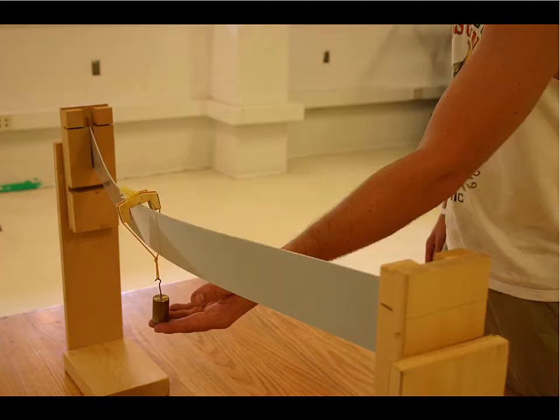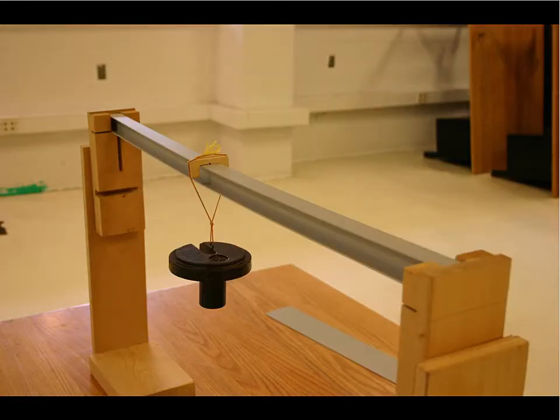We also talked about the fact that we can make the beam self-bracing. So instead of a 3 inch deep styrene beam, we can take that and cut it into 3 1-inch wide strips and glue it back together in the form of an I section, which has a 1 inch wide top flange, a 1 inch wide bottom flange, and a 1 inch deep web. And this system is not only deep enough and stiff enough, but it also is able to take a lot more weight because the performance is no longer limited by elastic instability or lateral buckling of this web material, because the web material is braced on the top by the top flange.